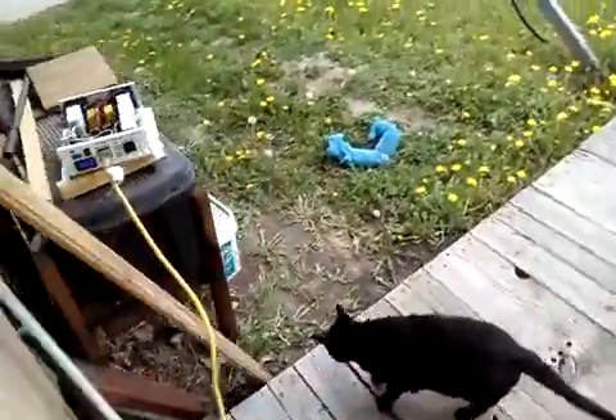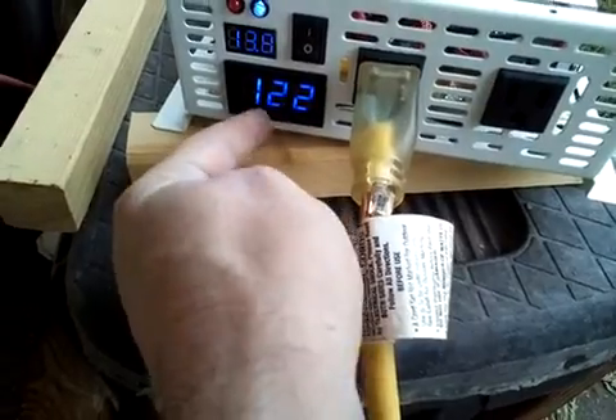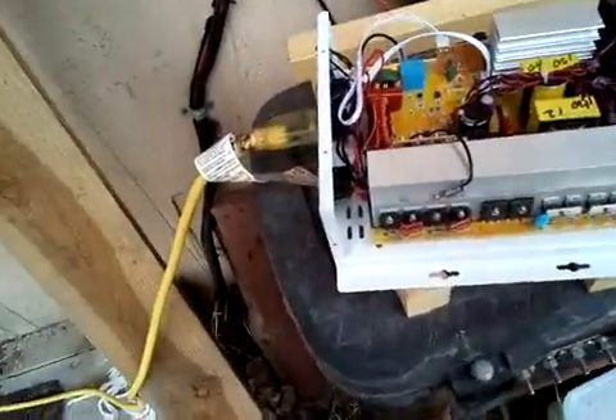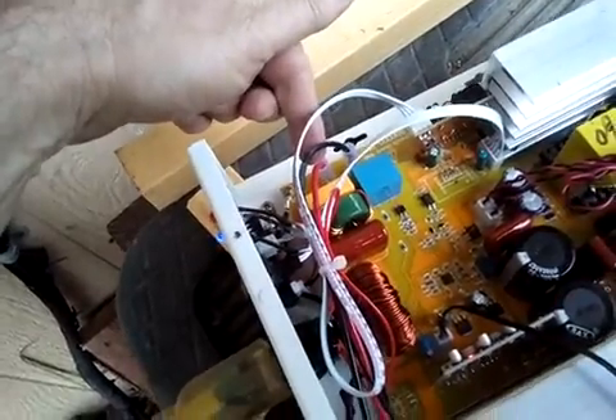I have a cup of cold water here. Just like any other inverter, I will test this — this is the replacement. When I first turned it on, it did not light up at all, nothing. It showed 13.7–13.8 volts but did not light up. When I took it apart to check for a blown fuse, this red wire — the hot power wire — was 100% completely unplugged.